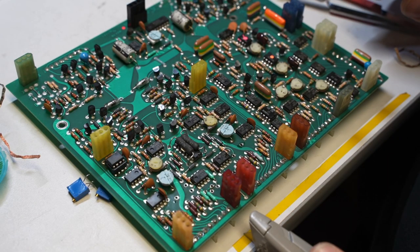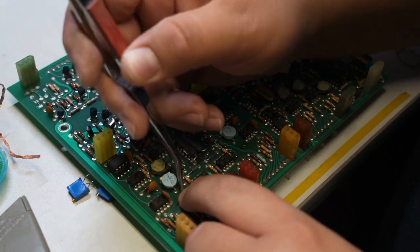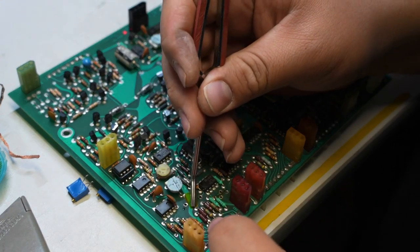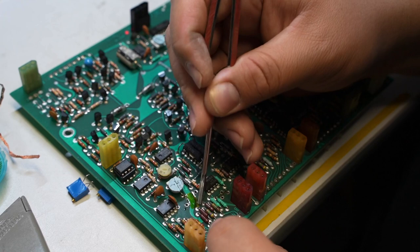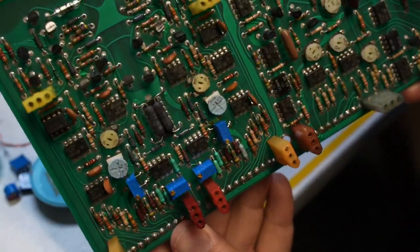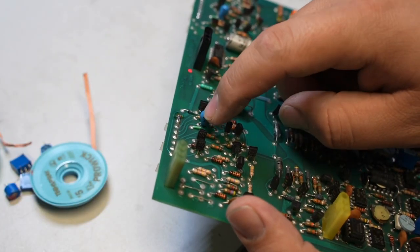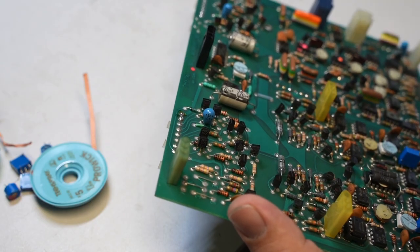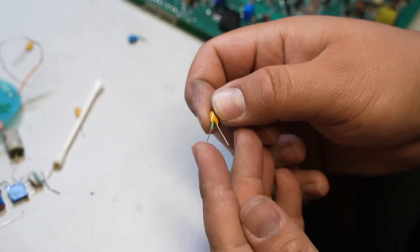To aid in tuning stability, the initial tune and volt per octave trimmers are changed for both oscillators on each SEM. Here we see Rob putting insulating tape over the solder mask so that the trimmers can be affixed to the board securely without potentially shorting to the trace underneath. This is commonly overlooked by other technicians. The tantalum timing capacitors for the envelopes will be changed as well, and for posterity's sake, the original heat shrink will be transferred from the old caps to the new.